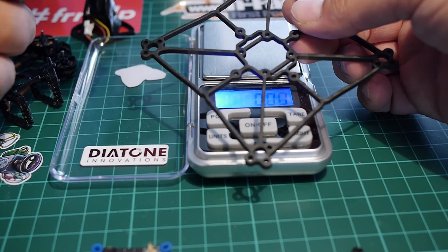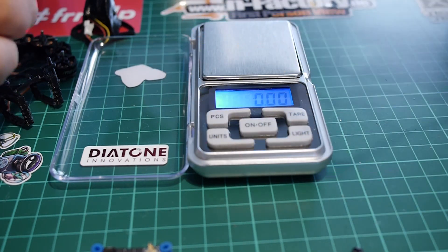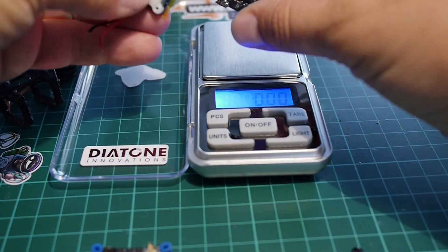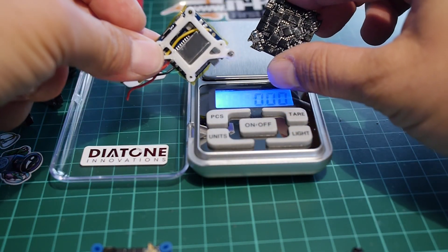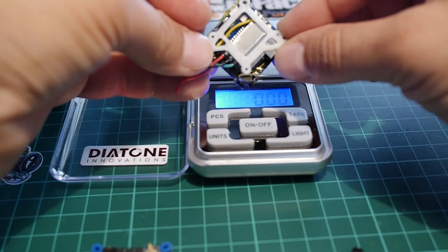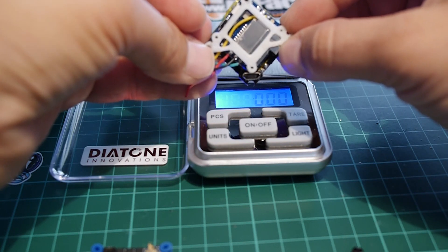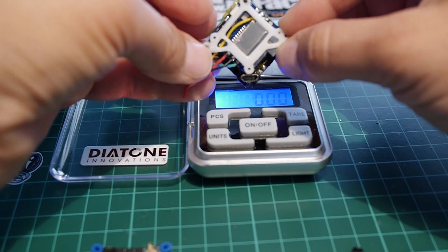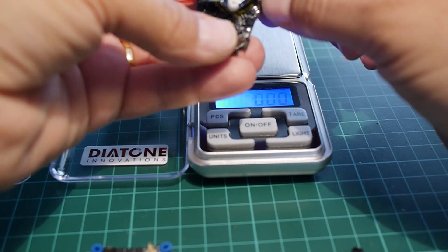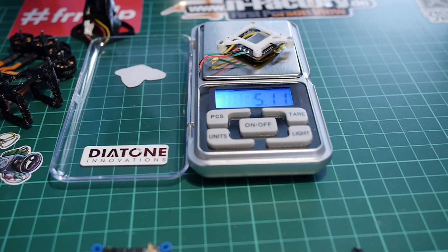You can't do any workaround on this frame. So the DVR with this custom TPU mount comes up like this on the board. It's a bit off-centered, but it leaves the USB port reachable. This mount by itself with the board is 5 grams, so on such a build with the DVR, you have some extra weight.